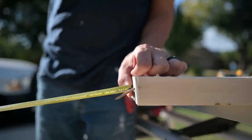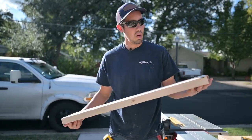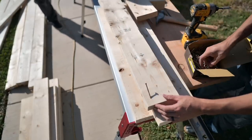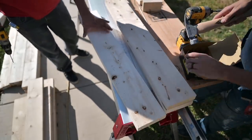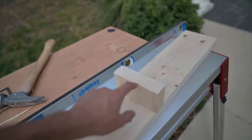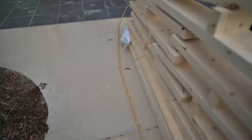Those two are dead on. I'll drive a screw through there to show you how much of that three inch screw is going to grab and bite into what we've already got up there. By the time I give it a full send we're looking at about an inch and three eighths bite — that's plenty strong to do what we need. So we're going to do that to all twelve of these smaller boards, put one block in the middle, and when these go together they're about three foot on center. We've got them all right here and they're ready to install now.